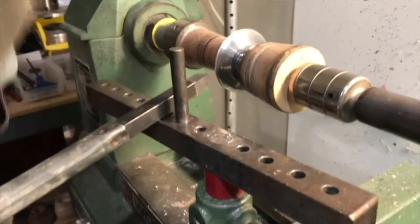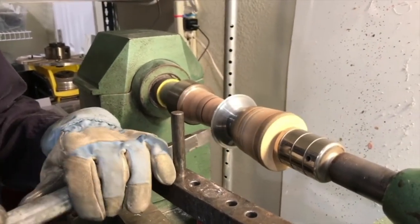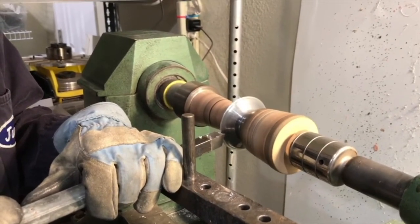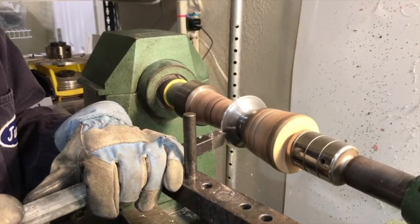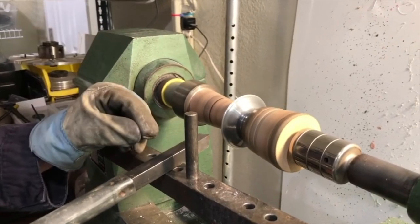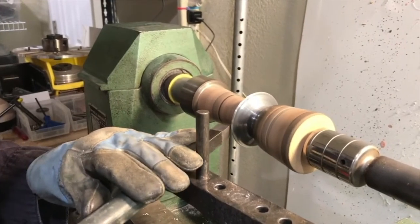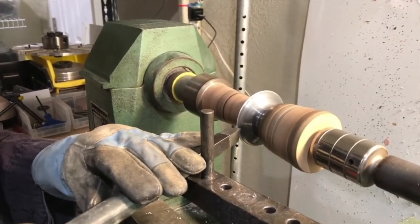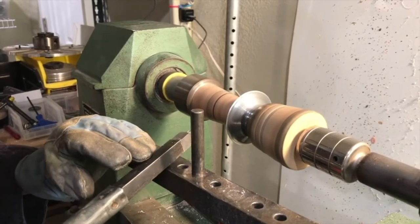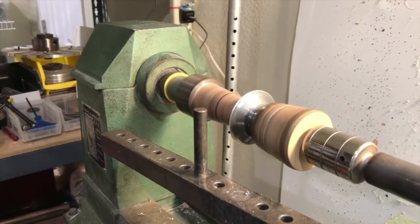Make sure you're using all proper safety equipment like a face shield and gloves. Trim and make sure it's completely centered — this is the last chance you'll have to reach the edge, so make sure it's cleaned up. You can stop the lathe and file it, or if it's not critical you can trim off the burr on either side with the lathe tool. Make sure it's perfectly concentric; trimming it off will sort of half anneal the piece.